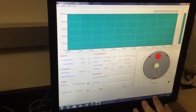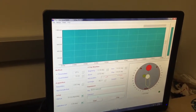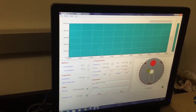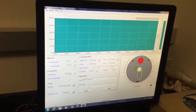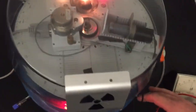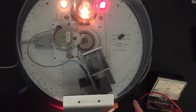You can change the beginning and end of your actual scan. For your crystals, set it at 21 to 116 and leave that alone. You're going to change this time-limited value from 0.5 seconds — you might make it 0.1 seconds. The resolution — you're going to want to make this better, because your scan is going to want to take about 45 minutes to get a really fine-looking scan. We're going to leave it at 0.5 seconds and 0.5 degrees just to give you a quick scan to show some of the peaks. We're going to hit start. The arm is going to go to that starting degree at 21 degrees — watch this cable; if it gets tangled it will grind up the plastic gears.